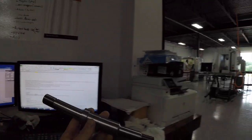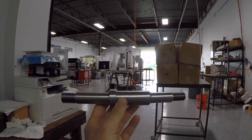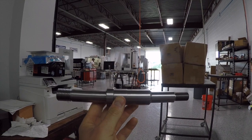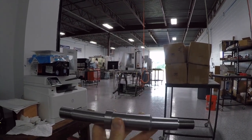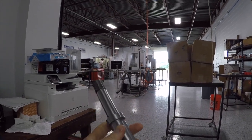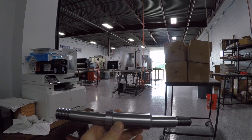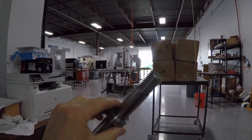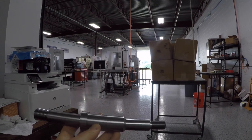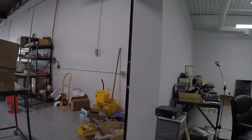We just did this shaft and I love the Tormach lathe. Sometimes I get frustrated, mostly related to the bigger diameter stuff, but it's an awesome machine. We took this piece - 1.625 inch, I believe it's 4140 - and there were a couple of bearing tolerances on here that were well inside of a thou. We nailed them on the first pass. We did this without a tail stock, just flipped it and dialed it back in. Great quality, the threads are great. The lathe is really coming together, which is awesome.